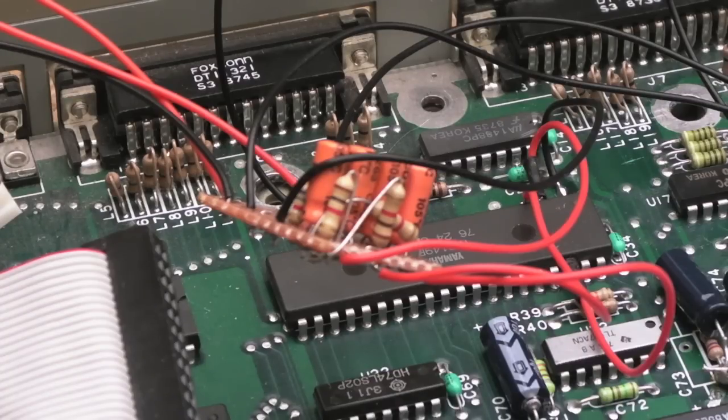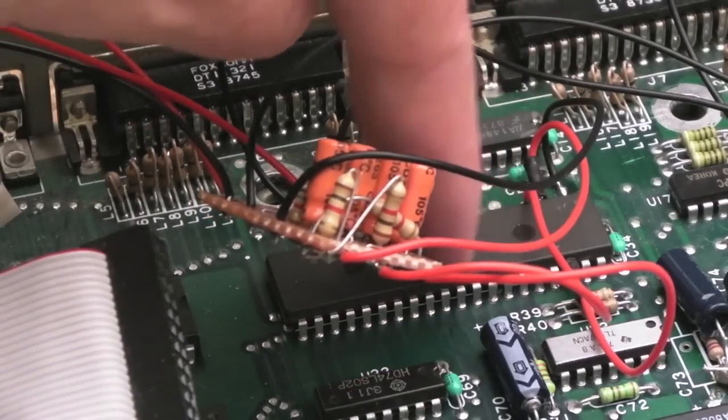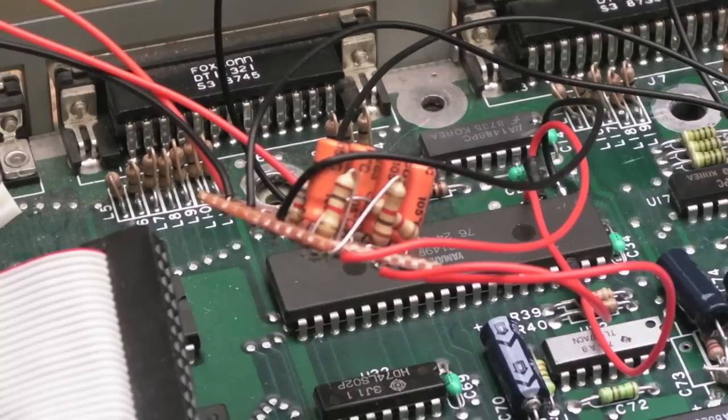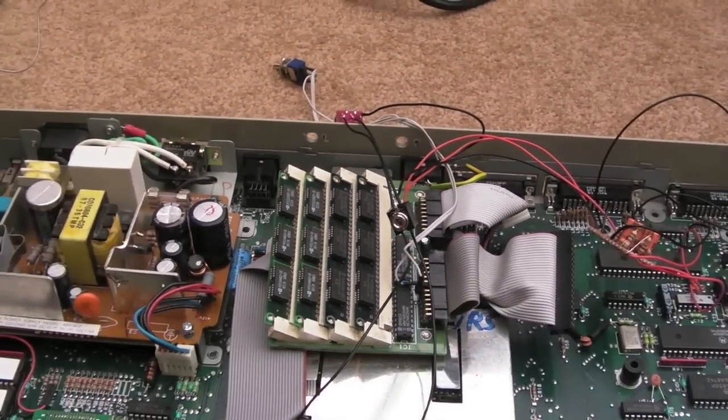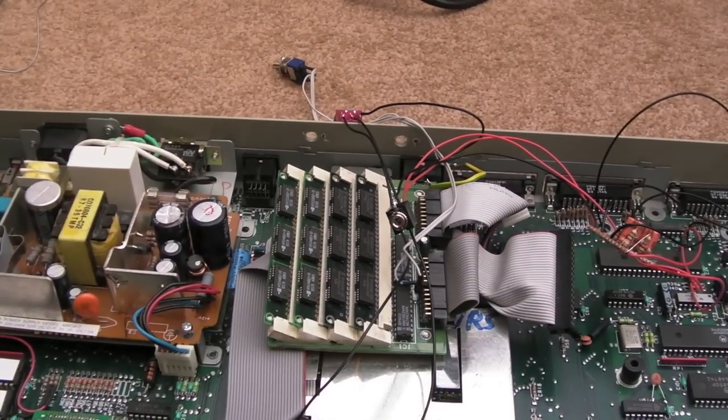So all I did is swap my left channel and the centre channel wires round that come from the Yamaha chip here, and retested it, and that's fine. So now when you've got the standard key click for GEM, you'll hear it in both speakers just like you would normally. It sounds just normal. But then you load a game up and it's stereo. That channel is obviously split between the left and right ears. Anyway, I'll reassemble this now, and I'll record some gameplay videos later so you can hear what it sounds like.